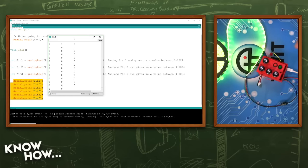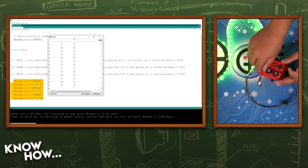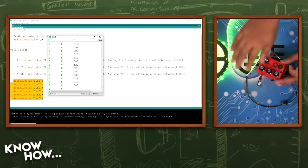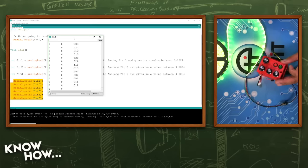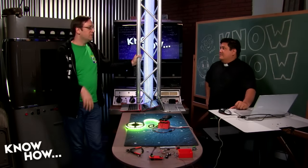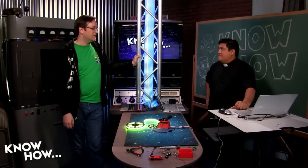That's going to be very important. You need to run this on your potentiometers because yours might go from 70 to 800. And you need to know that because if you have values that are out of the range of that potentiometer, it means you've got values that you can never activate. You need to be able to error check for that, because you don't want to say, oh, I'll assume it's 255 and it's sending 1023. Precisely, everything blows up.